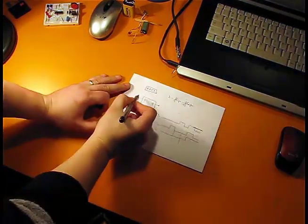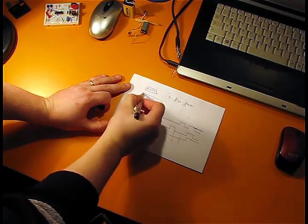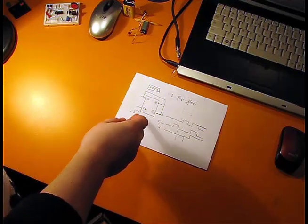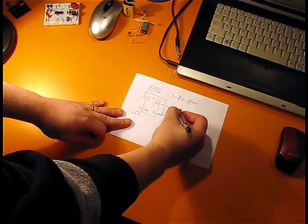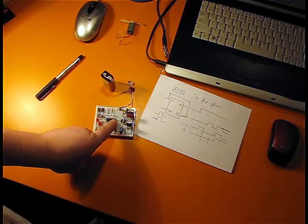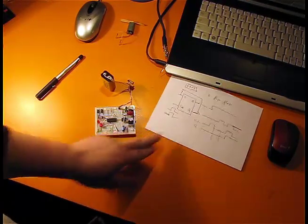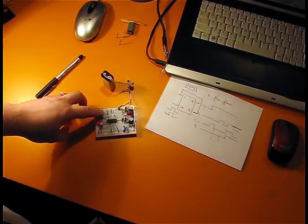And if I connect my Q inverted output to the D input, when I have a step signal for my clock, my output on Q will toggle. Here is how it works. This is the 4013 integrated circuit. If I press once, my LED will stay on. If I press again, it will be off. This one here too.